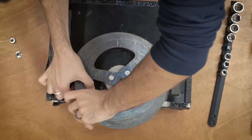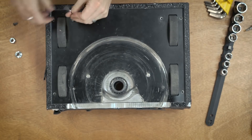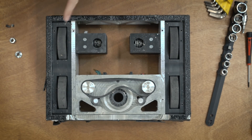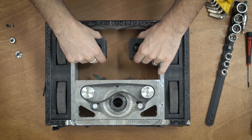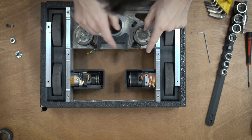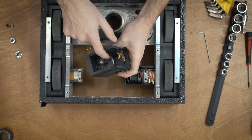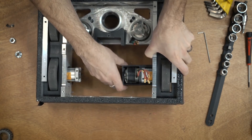I'm sorry for the next couple of shots being out of focus — I moved the tripod a little bit higher to get a wider field of view and forgot to change the focus settings. I really only want to do this disassembly once so I'm going to keep the footage. Here is the look inside underneath the armor. Interestingly, the only thing holding this motor on was actually the tripod screw, which is funny because it still drives just fine. You can see a big crack down the side. So I'm going to have to do something different with these adapter plates — the screws just threaded right out. I'll probably just make it out of aluminum.